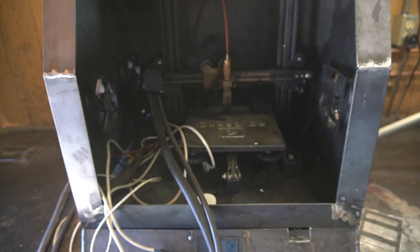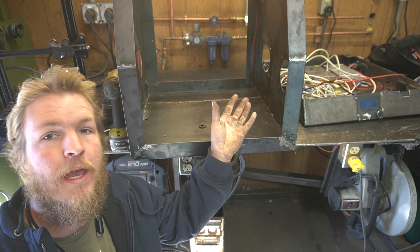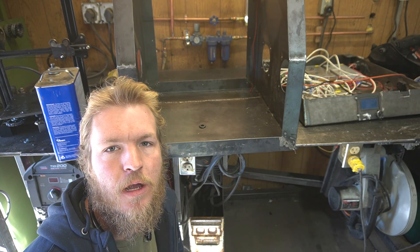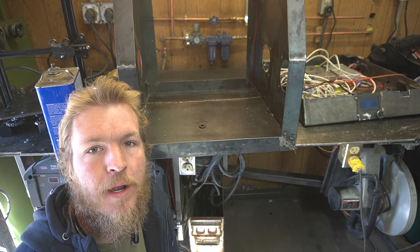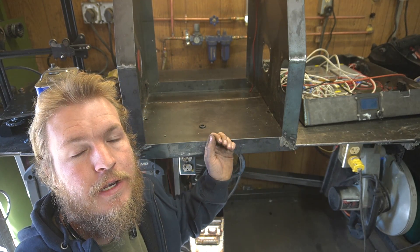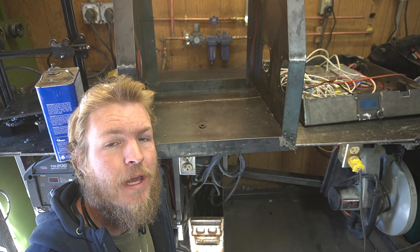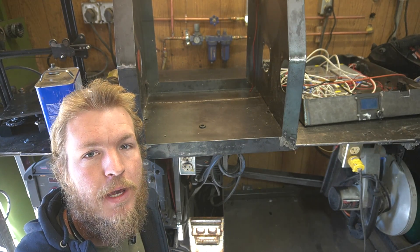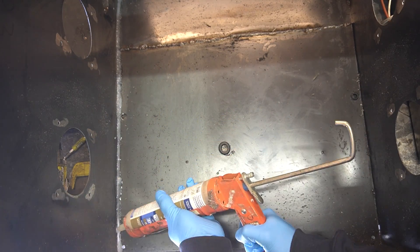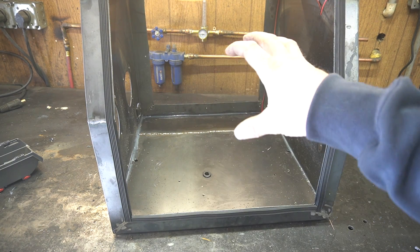Open the castle doors here. Now, first things first — the enclosure. I've cleaned it up as much as I can without using a grinder. It's covered in spatter. I'm not just gonna use the torch's argon, because I'll run out a quarter of the way through a print, and I'm starting to get embarrassed how often I'm going to the gas-getting spot. So I'm gonna seal this thing up as good as I can, fill it up with argon, and hopefully won't need to use as much. I'm sick of welding thin metal, so I'm just gonna use silicone. To seal up the doors, I've installed this weather stripping — I'll probably just hold it closed with some self-tappers to keep it good and tight.